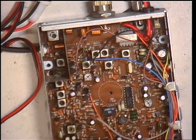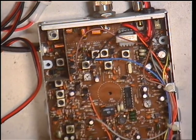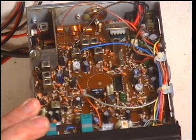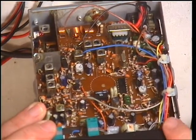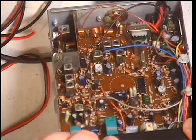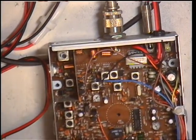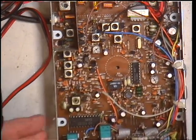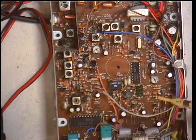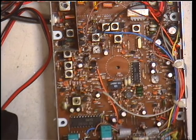That's today's fault-finding task. Let's see if we can do a tune-up on it — we'll start with the transmitter. I'm going to check it transmits on all 40 channels. I don't know the VCO setup on this. It's about there on channel 20. It's one of those sets that annoyingly starts off on channel 9 every time. Channel 1 — yep. Channel 40 — yep. So it's clearly had somebody messing with the VCO at some time. That'll be the VCO coil — you'd monitor the lock detector somewhere on the C5121 synthesizer chip and take it from there.